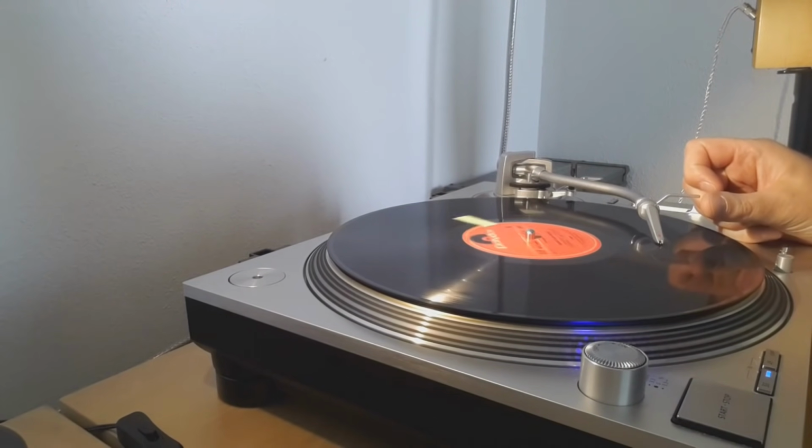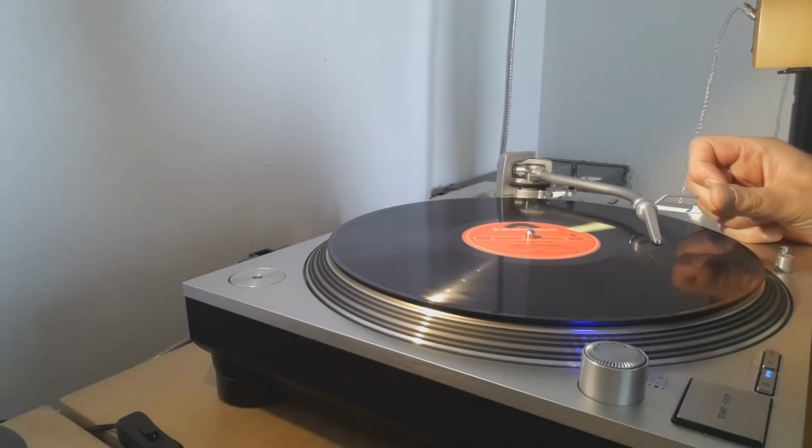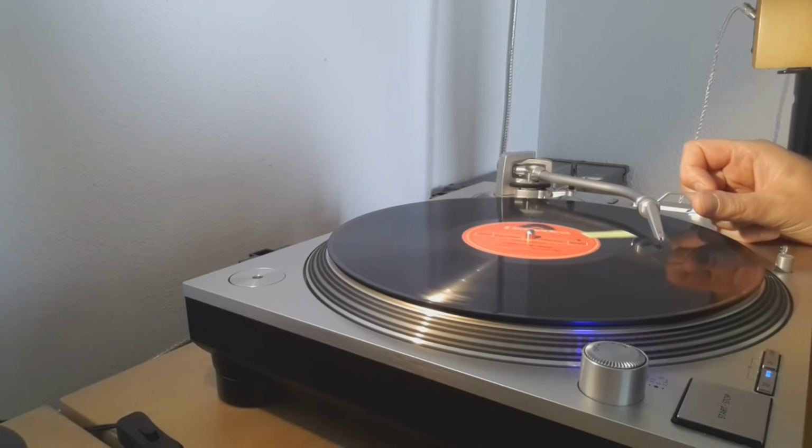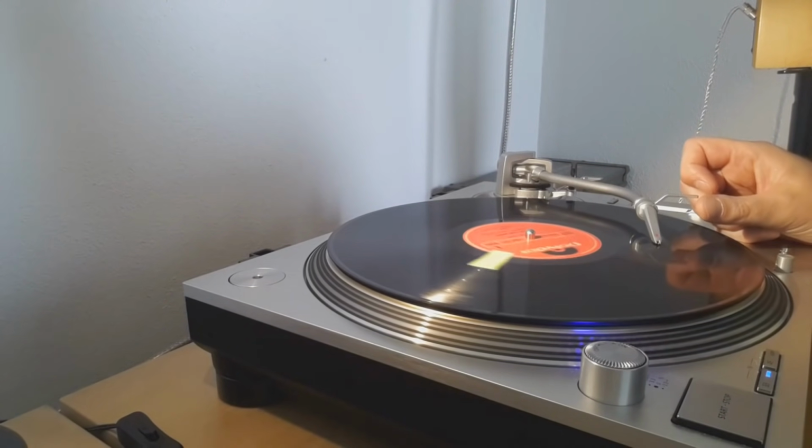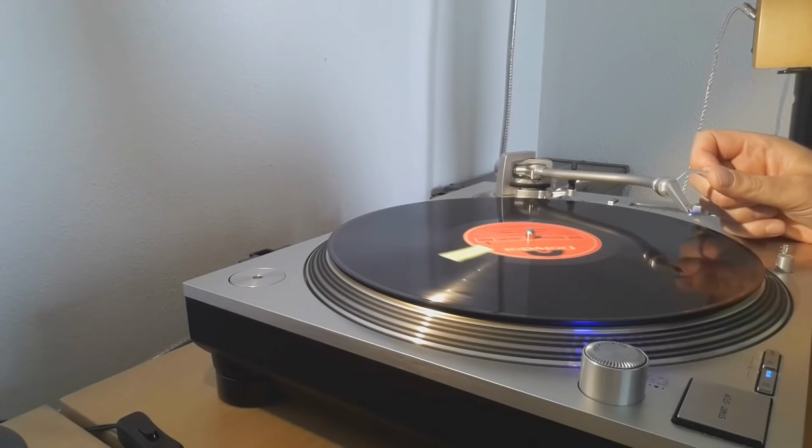Let's make some noise again. And just push it a little bit as soon as you think you're in the area where the loop is. And as you can see the needle, I'm pushing it slightly. And there I pushed over it. Maybe I pushed a little bit too hard, but I went over the loop. I'll do that again. So it's easier if you know exactly where it is. Pushed it again a little bit over it, and you can do this say 3 to 5 times.